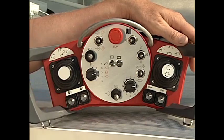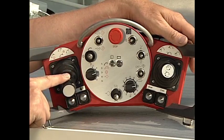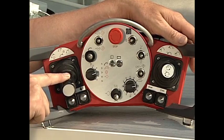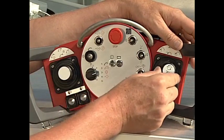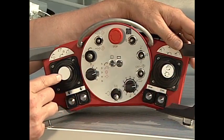After our pour, when we're ready to close up, pulling this joystick back fully closes the boom back to a folded position. We may need to swing the boom left or right in order for the boom to land squarely in the cradle.